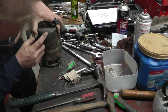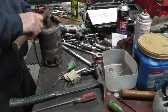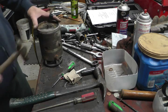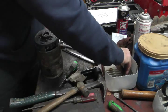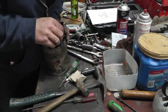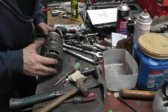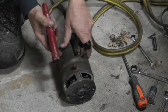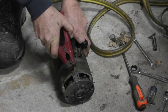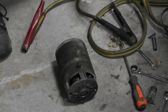I'm tapping here because I know that bearing fits in this part and there's a little bit of a tight fit against the outside part. We had these small, long, thin bolts. It spins nicely. I can look in there and see each of the brushes are in position. Looks good. Now I can sit here and put this thing back together.